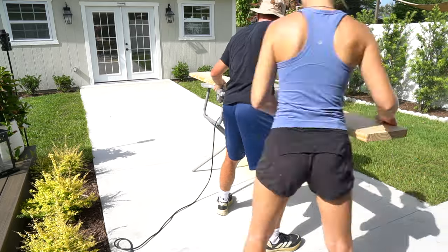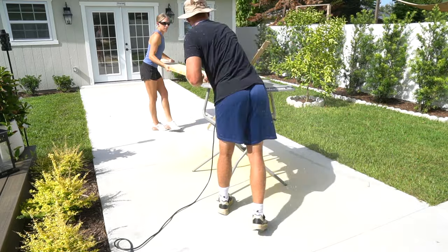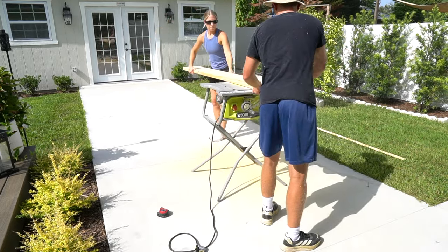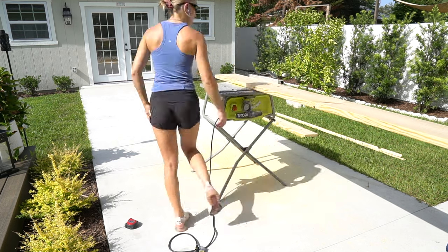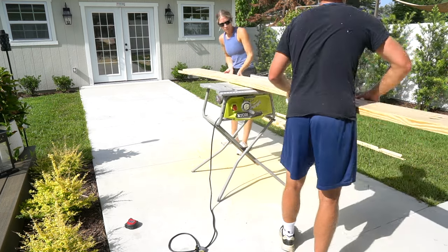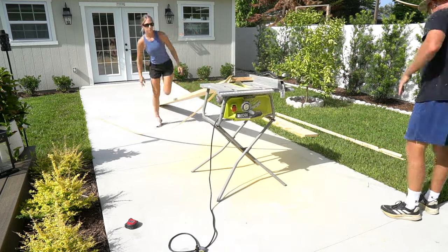After the boards were all planed down, we took them through the table saw. We ripped every board down to 8.5 inches so that the final depth of the countertop with the three boards will be 25.5 inches. We made sure to cut off both sides of the board to get that 8.5 inches so that each edge of the board was nice and square.